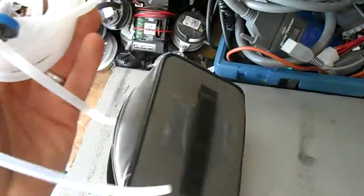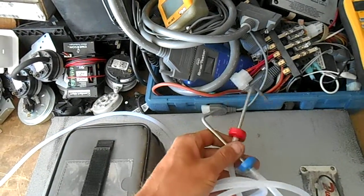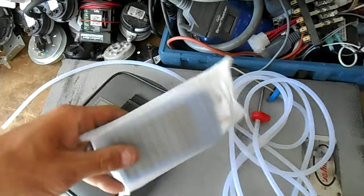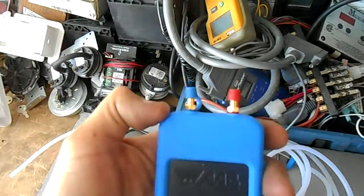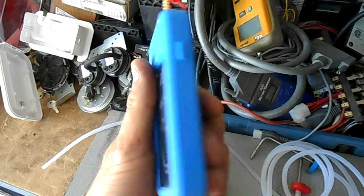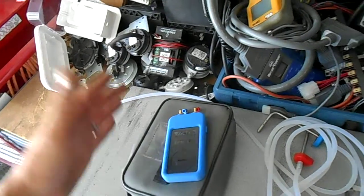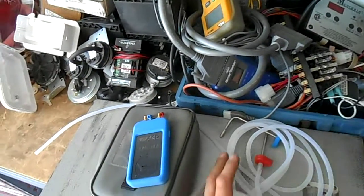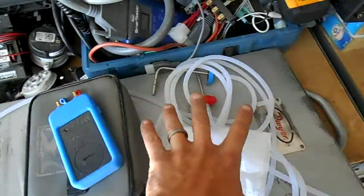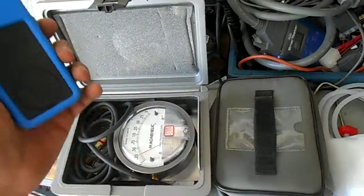So I've got my tubes and the pitots — obviously they color-code them. It's part of the app. It'll tell you where to put each pitot tube or static probe in the system, whatever you're measuring. Inside you have the SBM-100, still in its packaging. For calibrating purposes, you pop the caps, the app will ask you to calibrate first, calibrate it, and then basically it's Bluetooth and you've got it paired to the smartphone. Last week I did a startup on five rooftop units, all one next to another, and I drilled holes. I ran the pitot tubes off my Dwyer Magna Helic and ran these right next to each other in the same airflow stream. Surprisingly, the SBM-100 was exactly on with my Magna Helic.